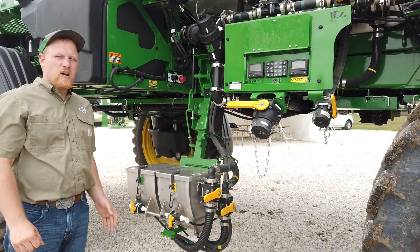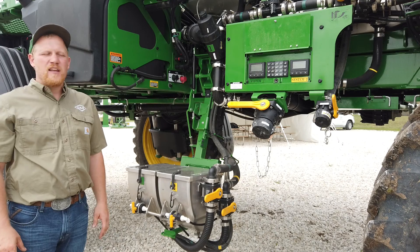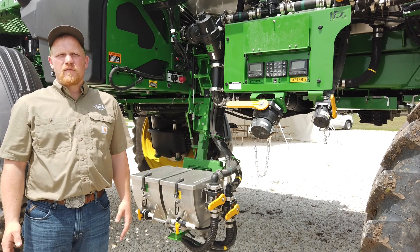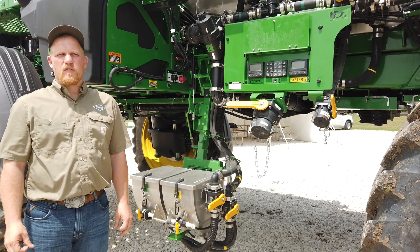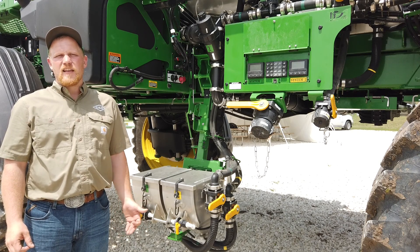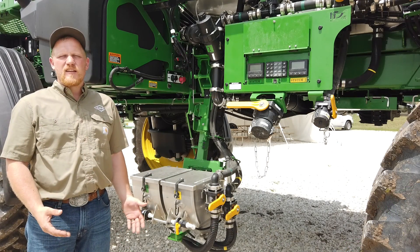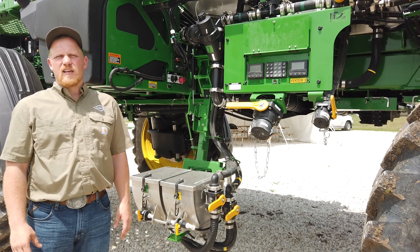For loading this system, we're equipped with two inductors to keep our products separate so we don't cross-contaminate if running different chemicals. We've also got a couple of options for filling. Using the side fill option, we can push product into both tanks through a three-inch fill line that uses an electronic valve up top to divert product to the correct tank. Something else different on this tank is that instead of pushing product down through the bottom like in previous models, we're pushing it up and over the top, then down a tube that's close to six inches from the bottom of the tank. We just ran out of real estate for the plumbing, so pushing it through the top and then close to the bottom still allows us to fill without foaming or causing issues.